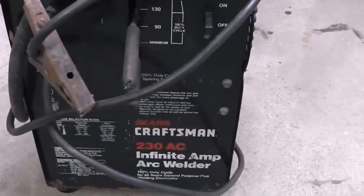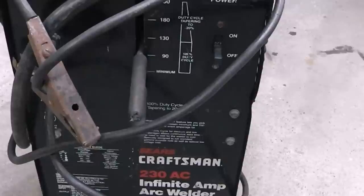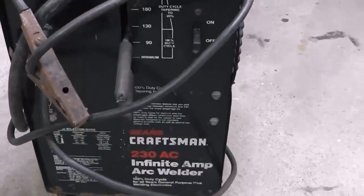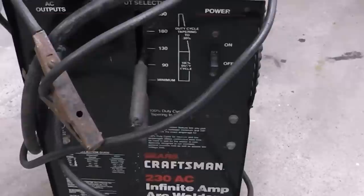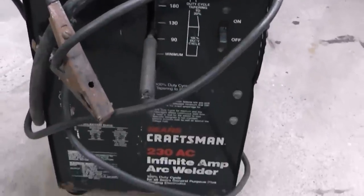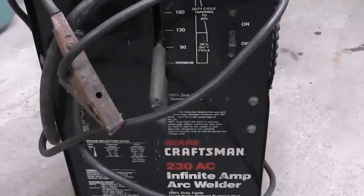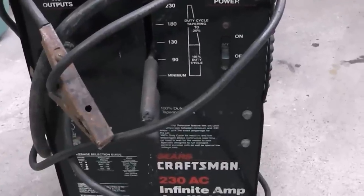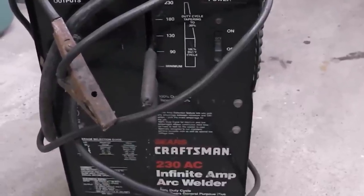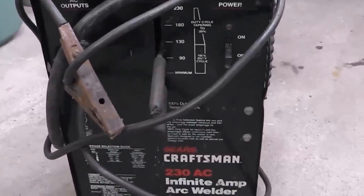The 6011 is an all-around pretty decent rod — it doesn't make a very pretty weld but it burns in nice. This welder will also run a 6013, and I'm curious to try the 7018s, so we're going to pick up a box of 7018s and give it a whirl. These welders are real affordable — I doubt this specific model is still made, and if it is, probably not with the same internals. The AC buzz box is a pretty cheap way to get into welding. It's bringing me back to my younger days, maybe younger and stronger, though probably not as wise.